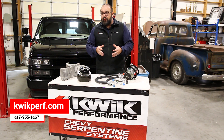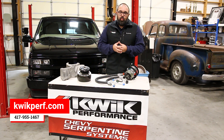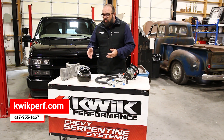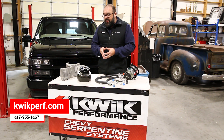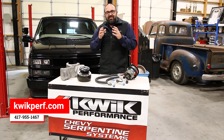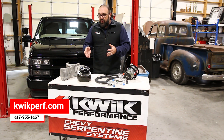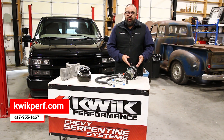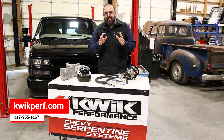It is 30-year-old parts, so even if you are already on R134A refrigerant, it may be time to go in and get some new parts that are more modern design and higher efficiency. One of the things our customers have reported about this R4 compressor is sometimes it's just leaky. There's a large seal around here and it just has a hard time holding refrigerant — it's a constant problem, a real headache. Also, some of the new ones only last a season. So we strongly believe in the Sanden mini compressor for its modern design and high efficiency, so you're going to get that reliability.